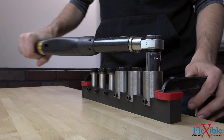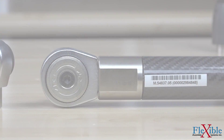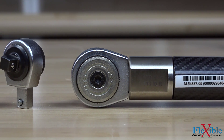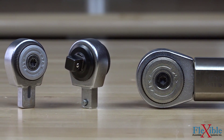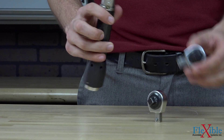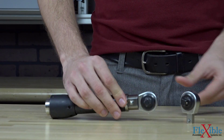Optional gyroscope models don't require a constant speed to acquire angle reporting accuracy of plus or minus 1 degree. End fitting tools come in various socket sizes and types and can be swapped in seconds. Certain models come with Atlas Copco's patented tag solution — these embedded tags can be used as a P-set selector when connecting the smart head and for automatic socket recognition.